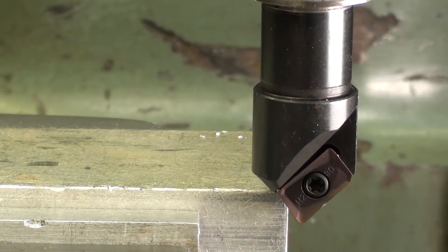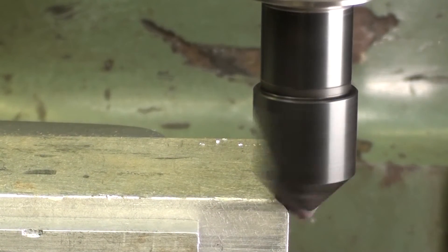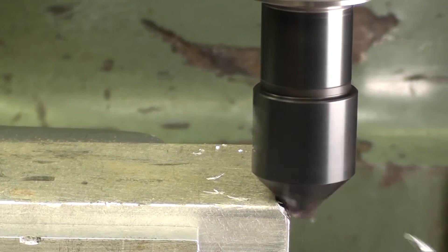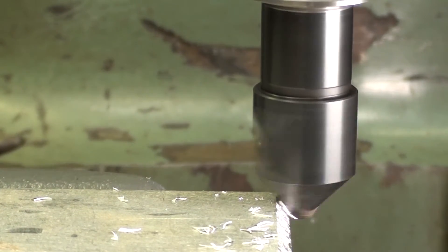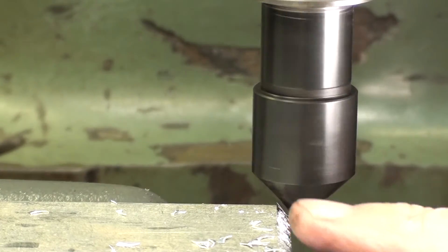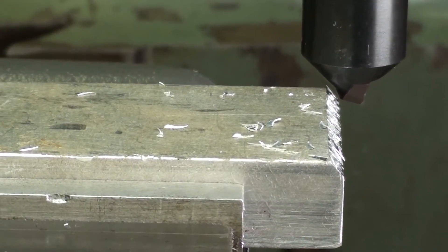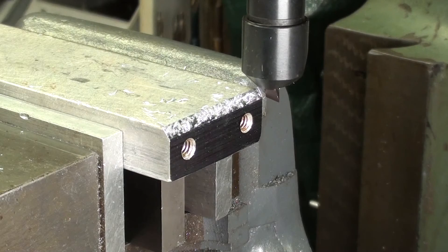Finally, after the detour, we are ready to cut. I've never done this before, so we'll see how it works. This is three-quarter inch thick aluminum. It's rougher than a cob because I was conventional milling, and I haven't used lubricant — I want it to be easy for you to see. I probably should increase the spindle speed. I've fed fifty thousandths in the x-axis and I am climb milling — it usually gives a better cut. Actually, it always gives a better cut.